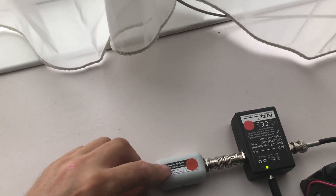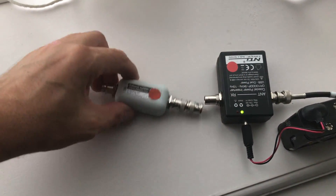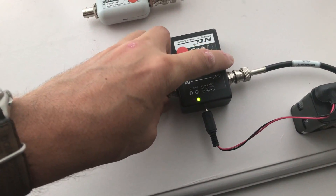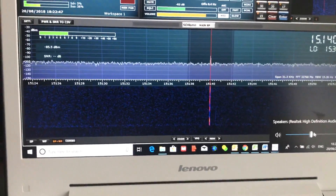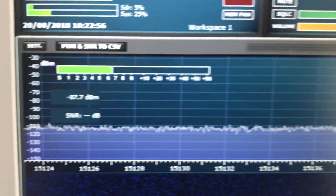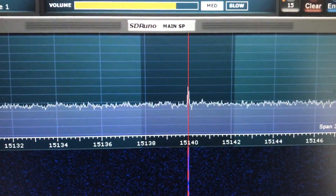Just to prove it's not a fluke, I'm going to disconnect it again and try without it. There it is without the galvanic isolator — galvanic isolator in place again — and if I now turn it up, the noise floor is back up to minus 110 dBs, signal to noise isn't registering at all, and there's no modulation, no recovered audio. So there you go.